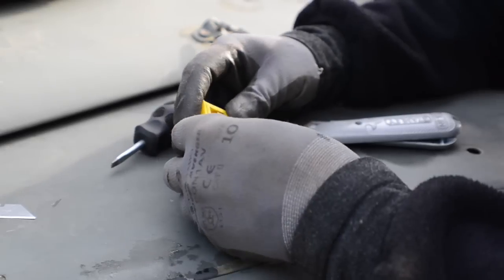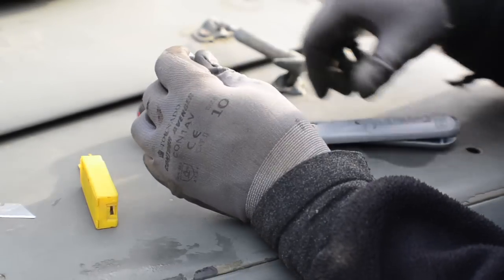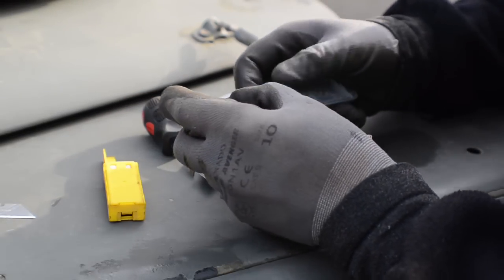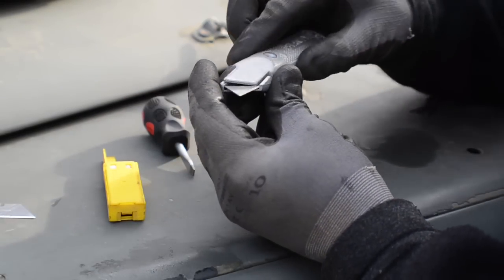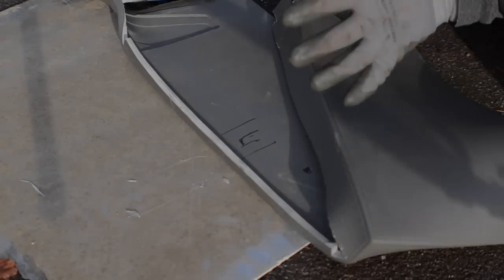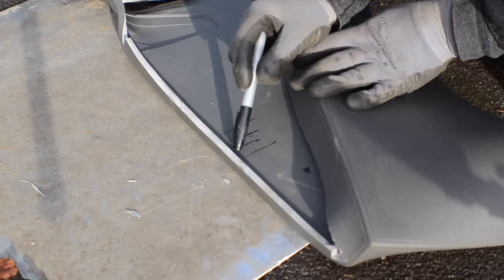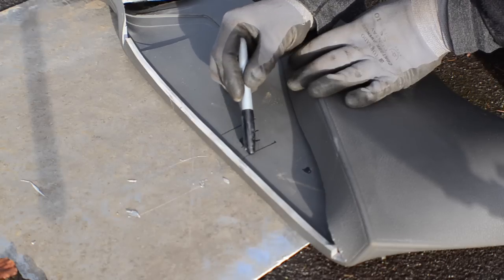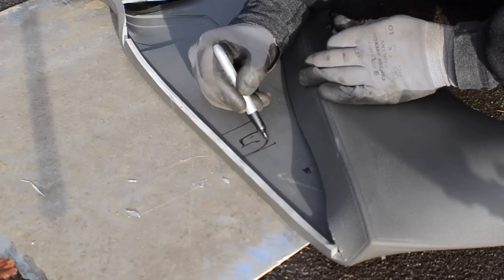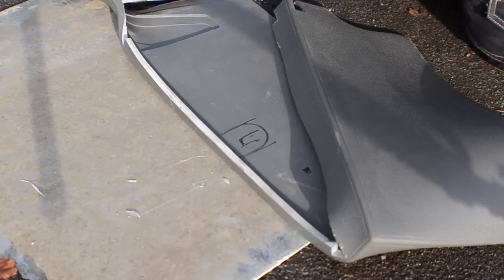This is the third blade I've used and I'm about half way through, so I can't stress enough how much easier it is if you just use a new blade. After every roughly two metres of cutting with a blade at the most, switch it over and get a new one in. So we've loosely cut the shape we need and we've noticed there are also witness marks on here where the latches are going to be on the boxes. If I draw a line around where that is, it makes it easier to cut and easier to see.